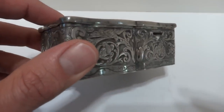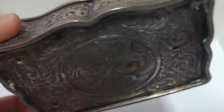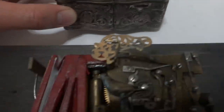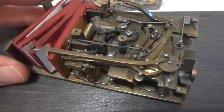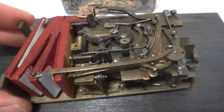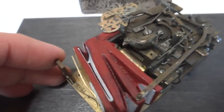This is the silver case — as you can see, there are wonderful engravings all around the case. I have the mechanism removed. I already went through the mechanism, cleaned, adjusted, and lubricated all of the pivot points at any place where the metal touches other metal. The bellows have been fully restored so it sings perfectly.